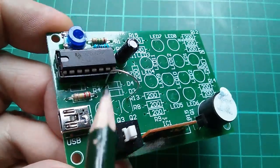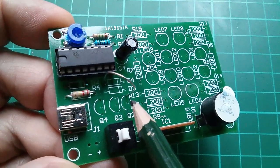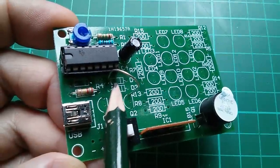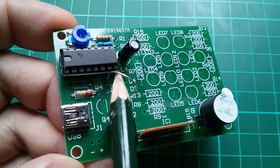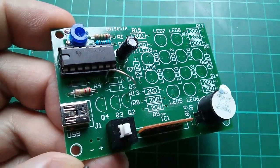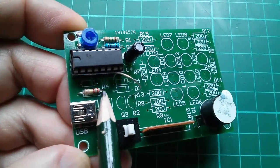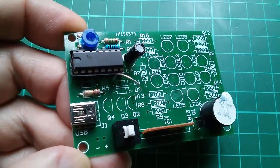I have a slight problem: the ground link I put in can no longer go to one of the transistor holes because I'm about to fit the transistors. But I've discovered I can run it down to the negative point, which is also ground. I'll put it from the diode anode — since I'm not fitting the diodes yet — down to this negative point. And that wire is pulling the reset pin of the chip down to ground, so I do need this wire to remain in, otherwise the chip won't run.